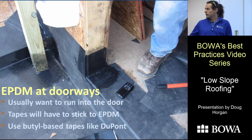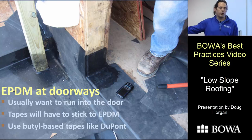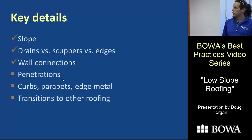If a door or window is close to an EPDM roof, run the EPDM into the opening to make a pan — you don't want a different set of materials there. But when you tape and seal the window, you can't use asphalt-based materials. You must use butyl tape and sealants compatible with EPDM. An easy way to remember: all DuPont tapes are butyl, so just buy those.